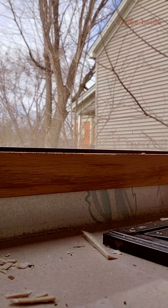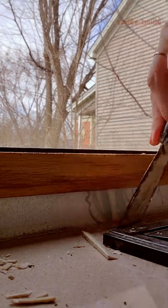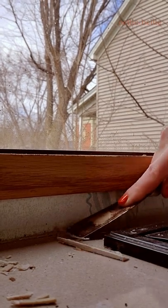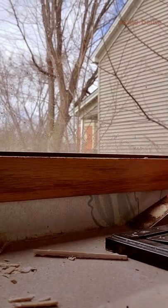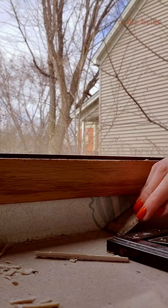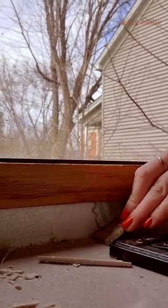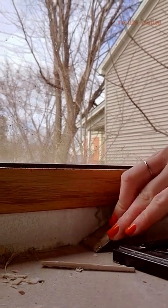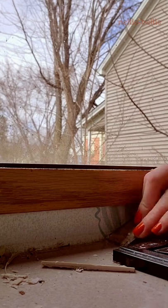It can come out fairly soon, though it can be a real pain in the neck. You'll see when I do the bathroom that the caulk was much more brittle and much more difficult to remove than the kitchen one. I'm cleaning up the surface here, and I'll eventually use Goo Gone — after I've done as much as I can with the stiff spatula, I'll use Goo Gone to clean up any remaining adhesive.